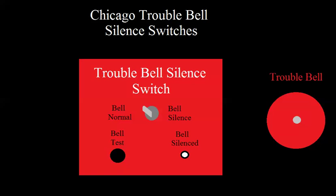The silence switch needs a couple of things. Let's say it's a 24-volt bell and a 24-volt silence switch. The silence switch needs to be able to test the bell. It also needs to silence the bell — so if the bell's ringing, somebody can acknowledge it and flick this switch to the right to silence it. When that happens, this little light down here would illuminate to let people know the bell's silenced. When the trouble condition clears, there's something called ringback — the bell will still be in the silence position, and it needs to start ringing again to let you know you need to unsilence it. Not all bells work exactly like this; some don't have ringback and silence automatically with a spring-loaded toggle. But either way, they'd be wired the same way. For now, we'll assume it's the kind that manually stays pushed to the right until manually pushed back to the left.